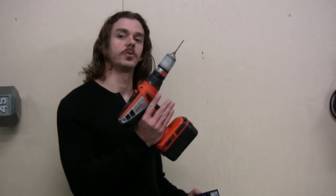Hi, I'm John Bliss with RJ Lockdown. I'm going to show you how to install the RJ Cinch Strap on a piece of plywood wall. First step, drill a 1 1/8 inch hole into your plywood.